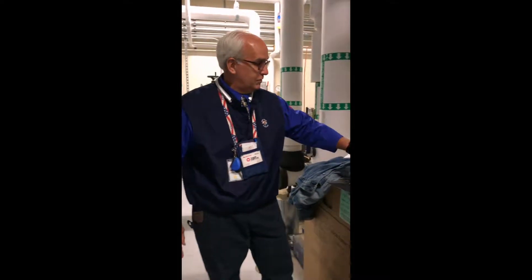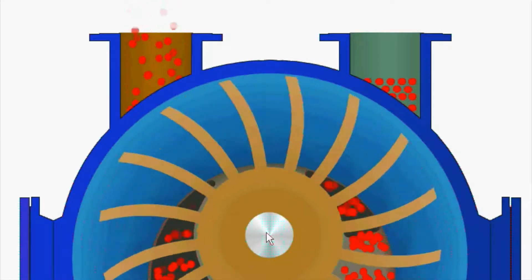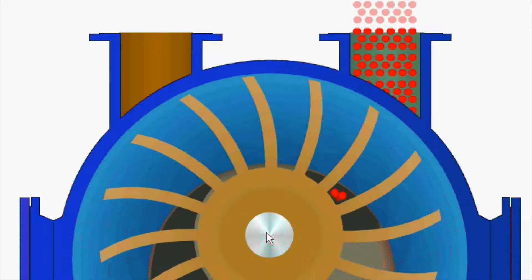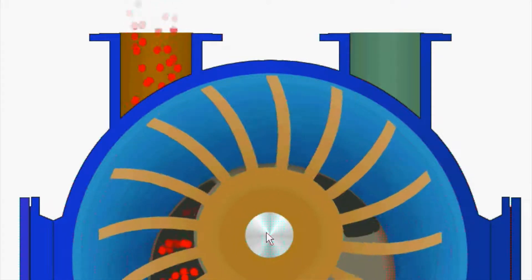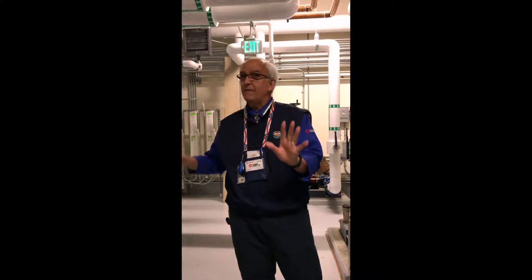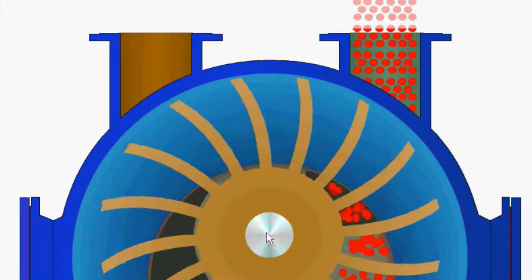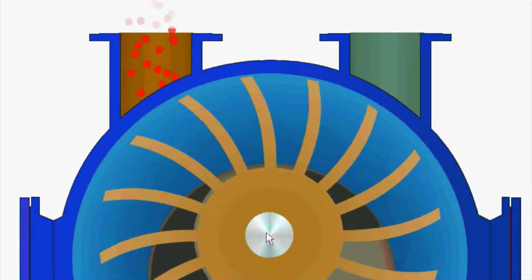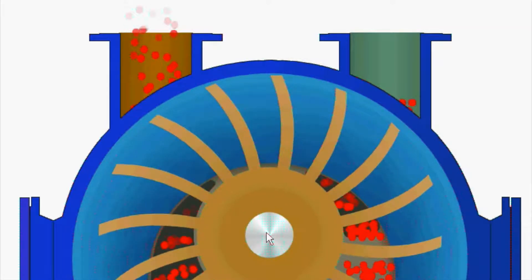This is a cross-sectional rendition of that pump sitting on the skid. The main components of a liquid ring vacuum pump are a shaft, an impeller on that shaft, and a casing. Outside of that, there are basically no other components — just bearings and seals. The blue inside represents the seal fluid, which is the sealing mechanism. That impeller does not touch the casing, so there's no metal-to-metal contact whatsoever inside the pump.